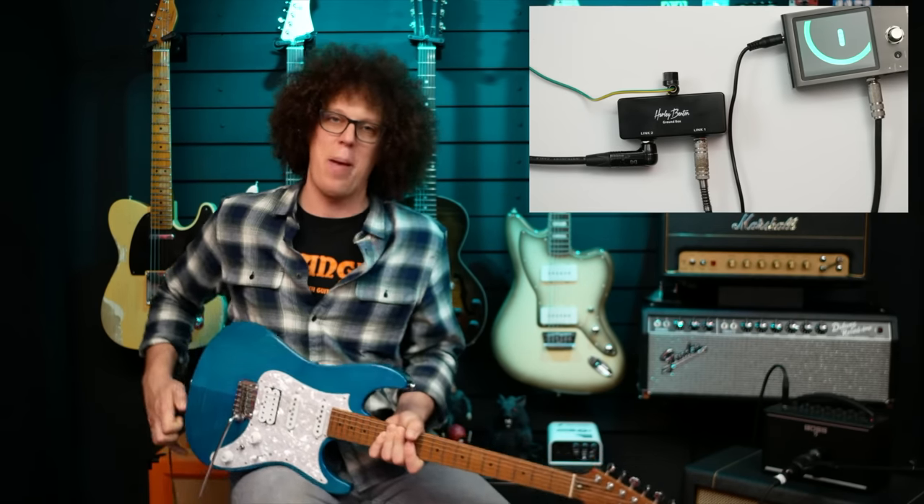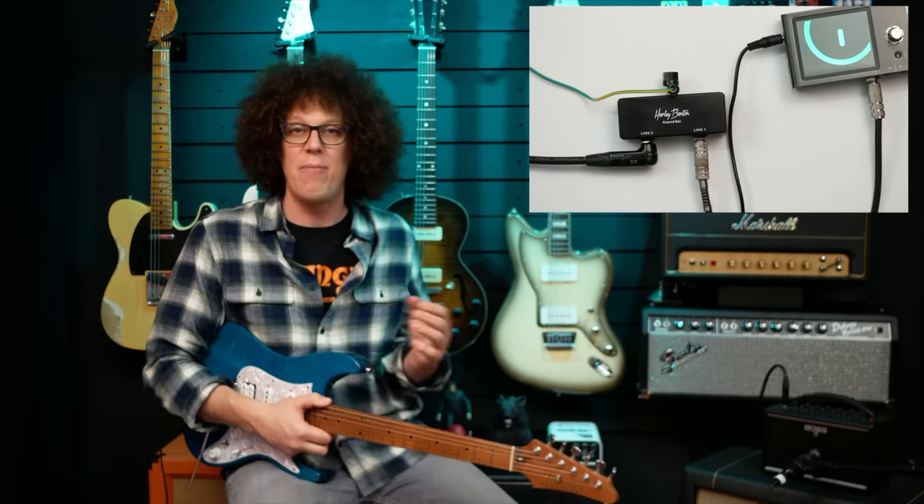Apologies for the noise in this video, but it's kind of necessary. If you are a guitar player — which you may be because you're watching this — it also works on bass and any other sort of pickup-based instrument. I really think you need one of these. The beauty is you can keep this on your pedal board and only plug in the mains cable if you have an issue, or keep it in your gig bag. If you're a sound engineer, surely you should have one of these — I guarantee you'll be working with people that have issues. This won't fix a problem if you have a crappy cable or a grounding issue inside your guitar. However, if it is caused by having a battery-powered amp and something plugged into the mains — or however you're causing your ground hum — get a Ground Box. Get it now before you actually need it. The best way to fix ground hum is to fix it at source: plug your recording device, computer, and amp all into the same socket if possible. If you're at a venue where that just isn't possible, then the Ground Box could be for you.